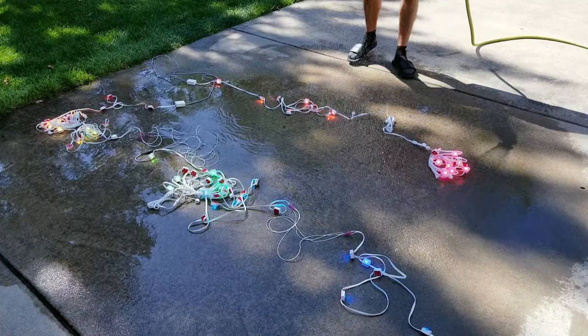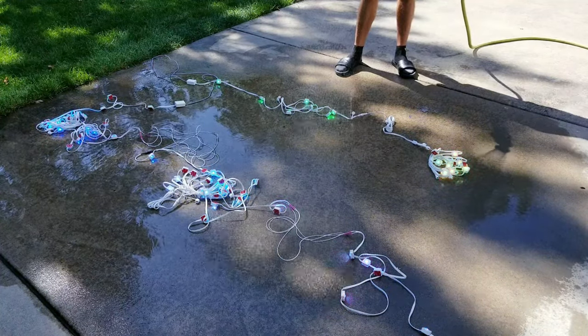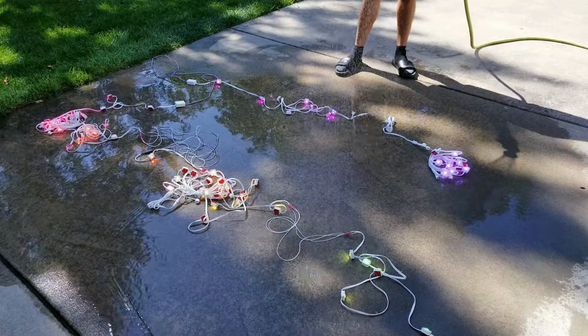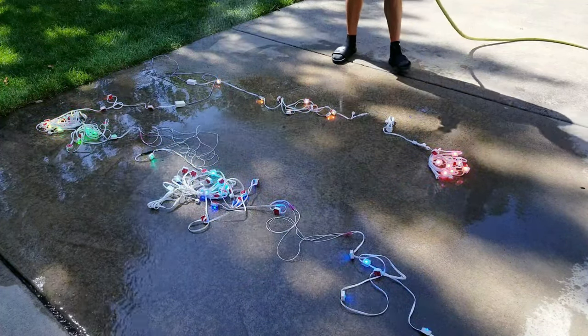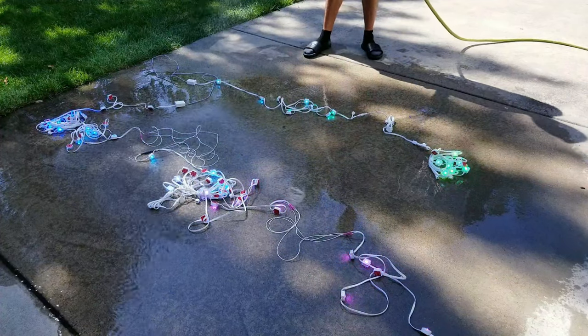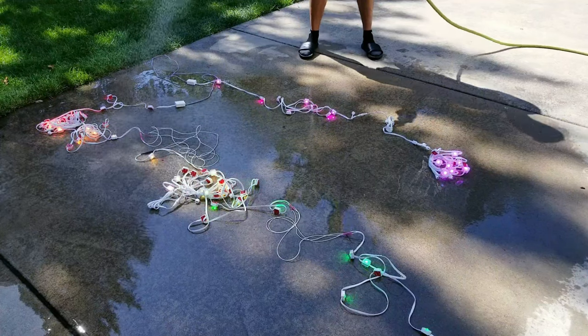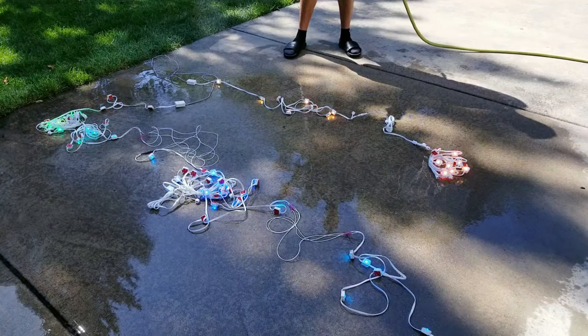So in conclusion, I personally would feel very confident making small modifications like I did in this video to ensure that these lights would be perfectly tailored to fit my house, but this doesn't mean you can just go ahead and add any length and number of wires you'd like. At some point, voltage drop would be too much and the lights at the end wouldn't function correctly if you're trying to add too much distance, so make sure to keep that in mind.